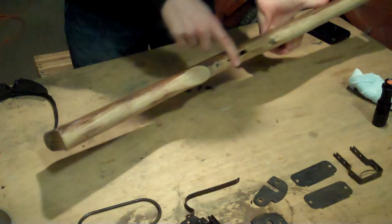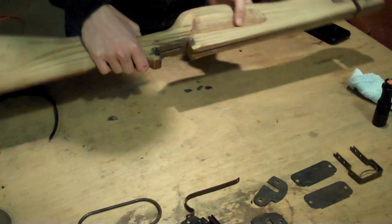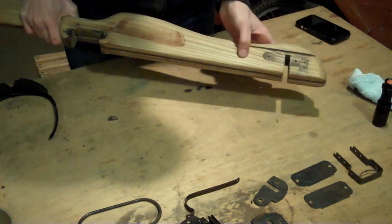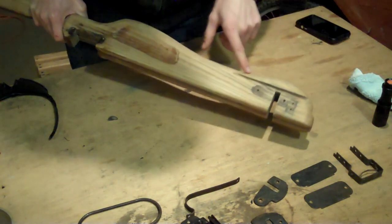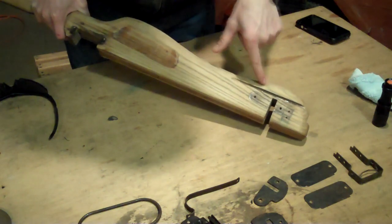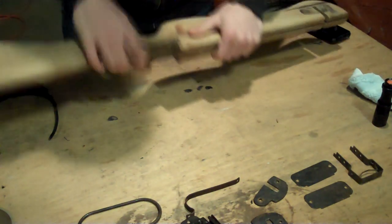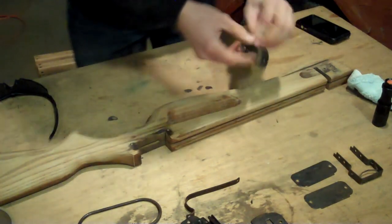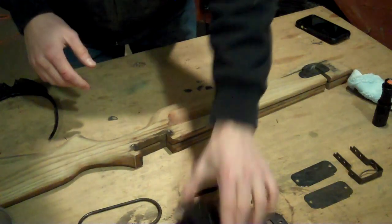I've done about a little bit past the width of it sanding-wise, so I only have this one face left to go. This little pocket here is a little bit harder to sand, so it's taking a little bit longer. Up here, the grain is just a little bit darker, so it's taking longer. The layers of grain are coming up, so it's a little bit rough there as well. I'm not too worried about right here because that's where the furniture and hardware sits — you'll never see it.